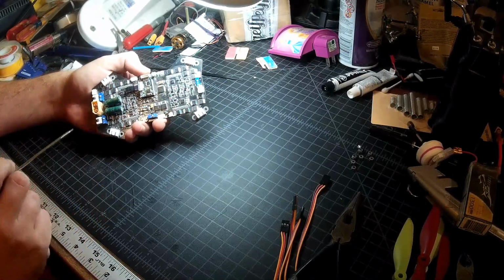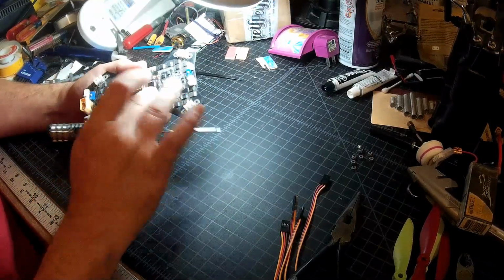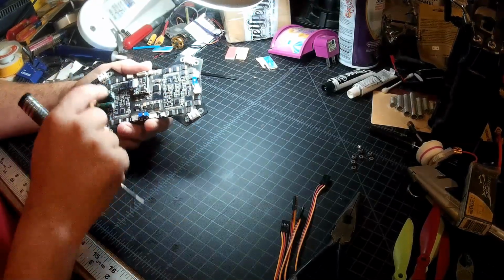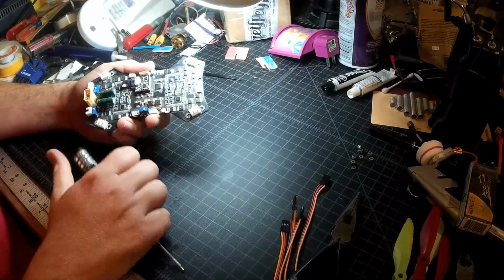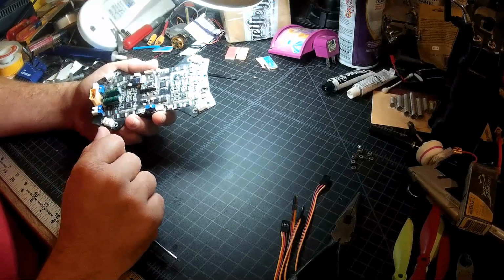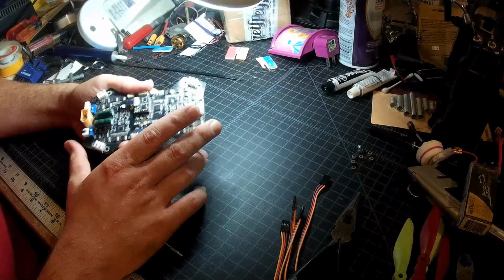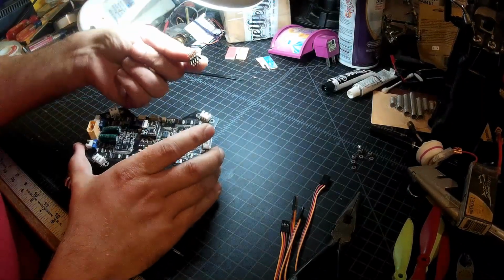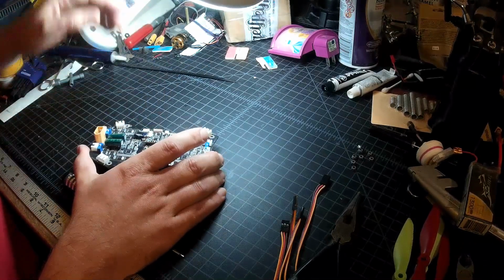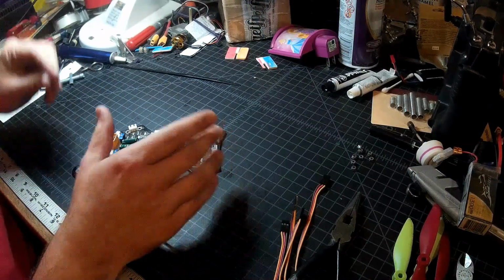Now my initial thought was that I was going to make a 6-pin header and wire just the 1 data line from each ESC, share all the clock lines, share the power, share the ground. So I'd have a nice 6-pin programming header. Unfortunately, I'm out of six pin headers. I have plenty of pins to do a pin header, I got them just laying everywhere, but I don't really want to do that. I want to do a socket, and I'm out of 6-pin sockets.